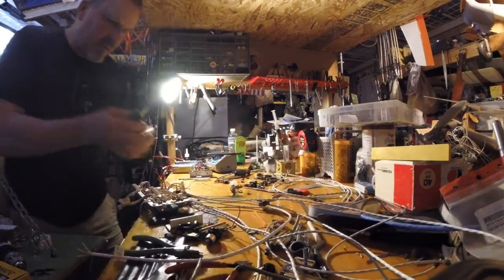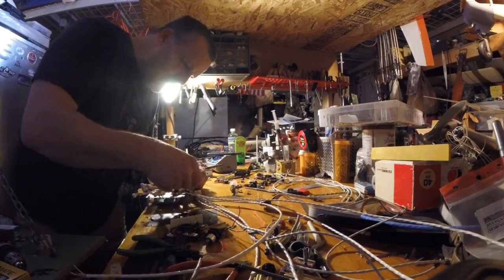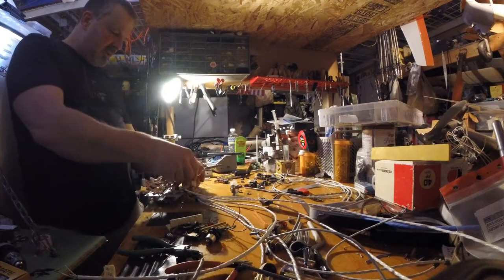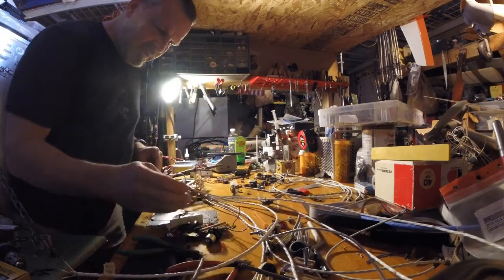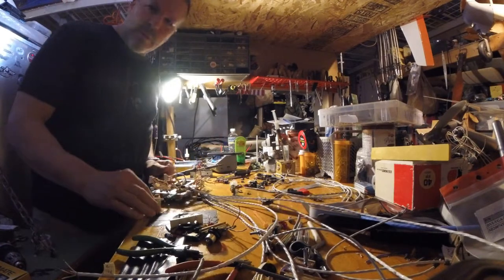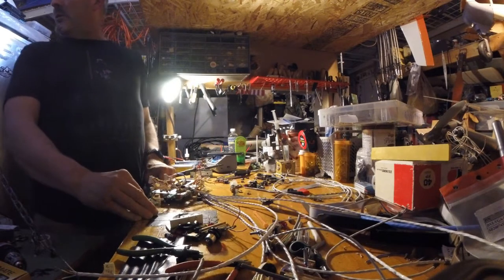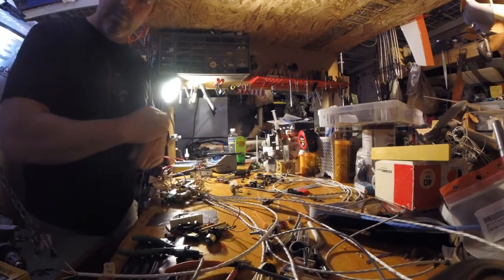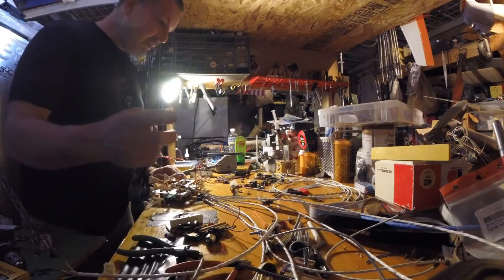As soon as I tuck in the needle clamps, it should be able to secure these wires right here a little better. And I've got two complete harnesses, two plugs already hooked up. And I just have these other two here. And then on top of that, I've already identified the other plug coming off the other backboard, where I'm going to have one switch there on the throttle quadrant going up or down. And then the other one is the gear switch for up and down for both those. And then the two slider switches, both of them are going to go into the collective and cyclic, just like I stated before. So, yeah, those are pretty much already identified. Got the wires already laid out.